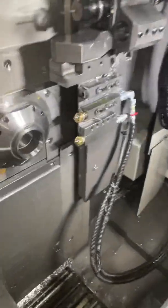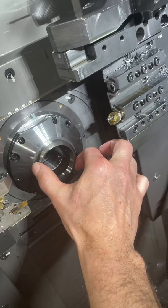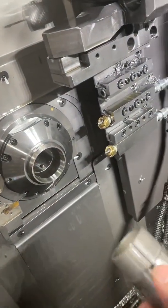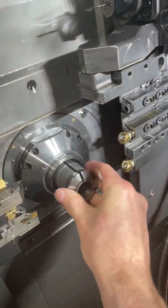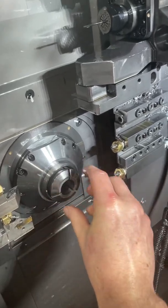So you've got your sleeve in. Just like every other guide bushing setup, there's a little pin there. You've got to fit the keyway of the guide bushing into that pin so that everything stays timed and there's no slippage. I'll get that in there like so.